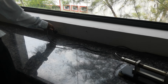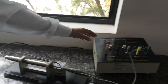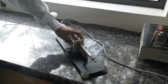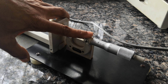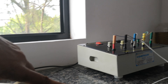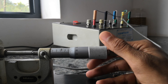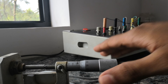First, connect to power and switch on here. Switch on here, then wait 10 minutes for warm-up. A micrometer is available; 20 mm total range is needed. Adjust the micrometer to 10 mm — half of 20 — and consider that point as 0. So 10 is treated as 0.